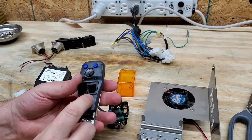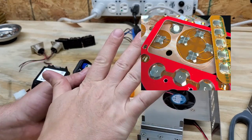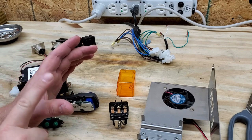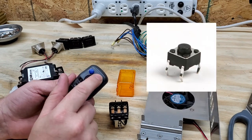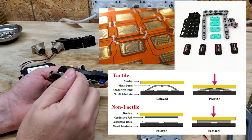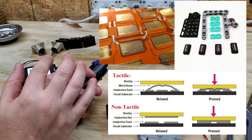See these silicone rubber buttons? You can hear the clunky clunk of them. That is because those are disc or dome buttons. A dome button has a metal dome, and when you depress it it closes a contact. On the perimeter of the button is usually your positive, and in the middle is going to be your normally open — so when you press it you're actually shorting between the outer ring and the inner ring. I'll throw an image up so you guys can see what that looks like. These are called dome buttons — you can hear them clickety clack, that's the dome that you're depressing.